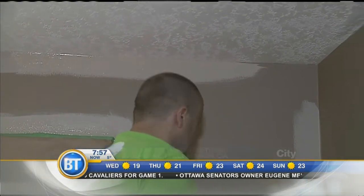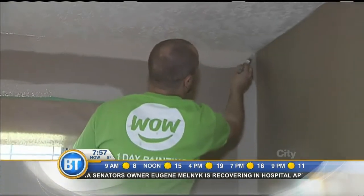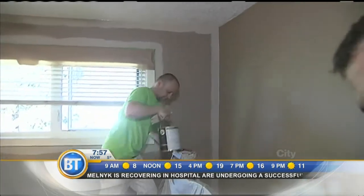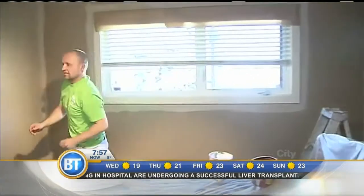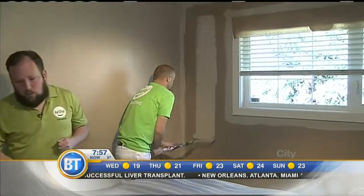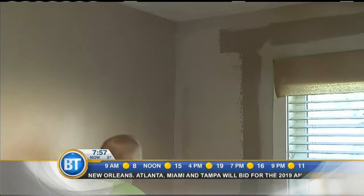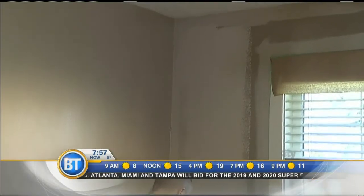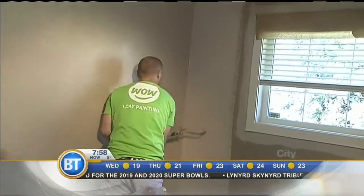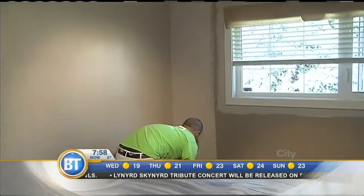We showed cutting in — now we want to show roller technique quickly. How much paint should be loaded on the roller? You're going to want to roll your roller in your paint first, then run it along the edges to get any excess paint off. Then start about a roller length away and work your way back, using the whole length of the wall so you don't get any runs or laps — that's what happens to most people: you get a run down the wall. This will prevent that.